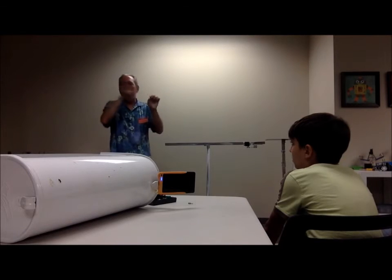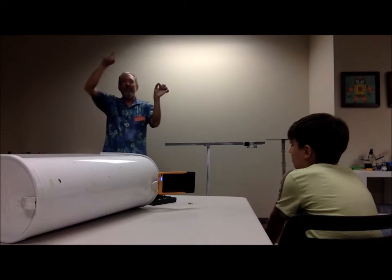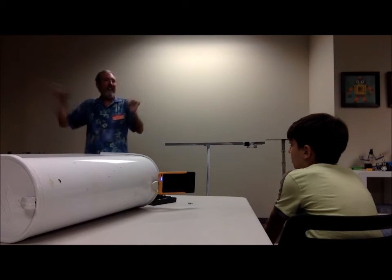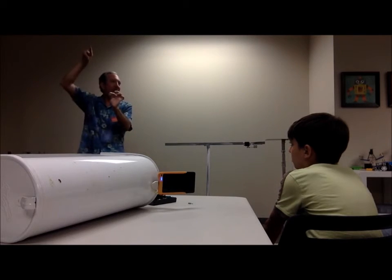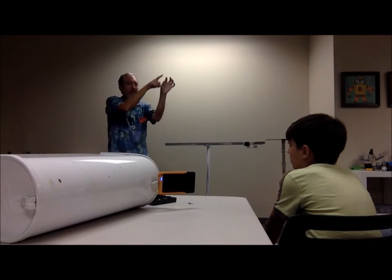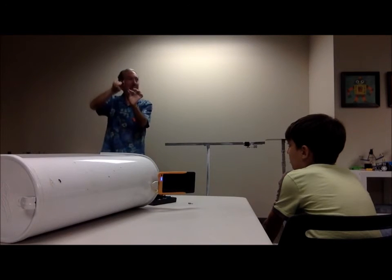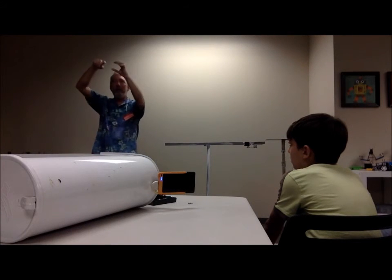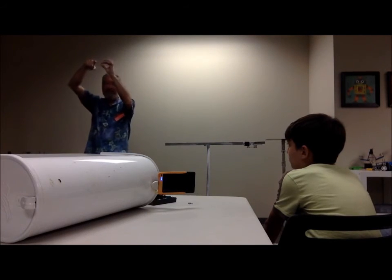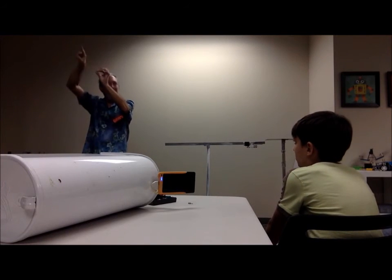It basically checks for the rate of change of the light. It constantly monitors the current ambient light, and then it looks for a rate of change beyond a certain value. So if it's dawn and it's barely light at all, it might be down at 5. But if it changes up to 10 really quickly, that means it was opened. During the day it might be noon. It might be at 75, even when it's closed. And then if it changes up to 90, then that means it was opened.